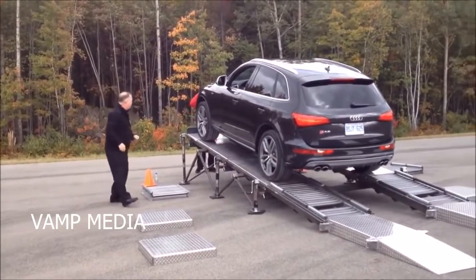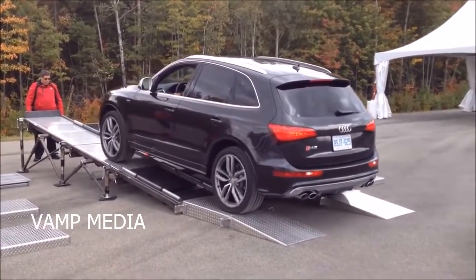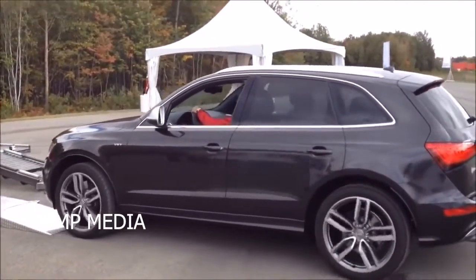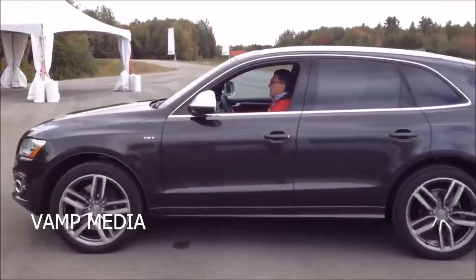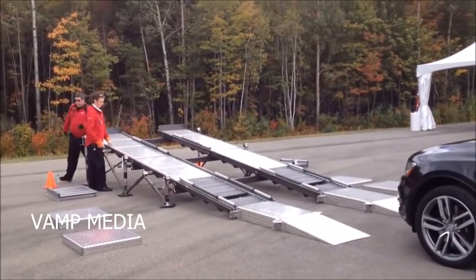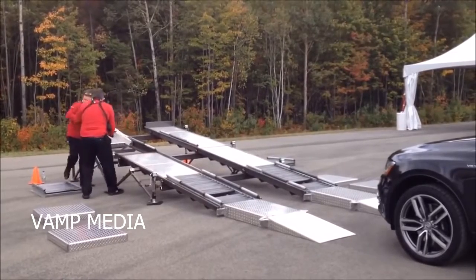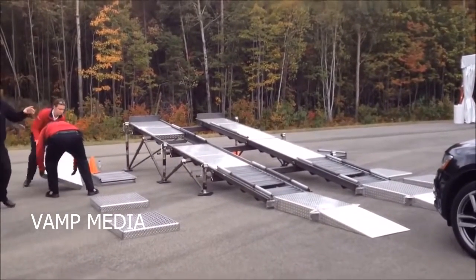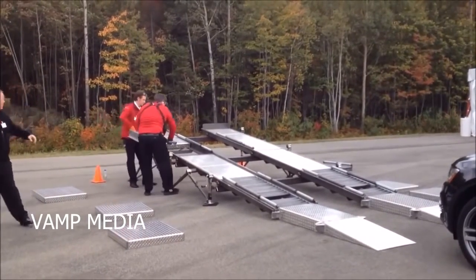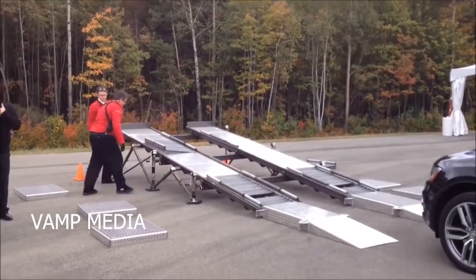We're gonna walk it down. Now what we're going to do is we're going to expose the vehicle to probably the worst case scenario. Only one tire sits on firm ground. All three other wheels are going to sit on the rollers. So we're going to actually crank at the rear, where 60% of our torque is going, we're going to nullify that. And then up front, we're going to create where Quattro is going to transfer more torque to the front.